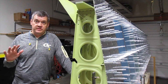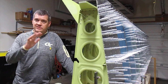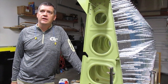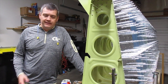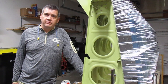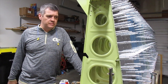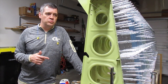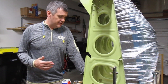There are a couple of methods of doing this — the plans even describe this. Typically you can use a rivet gun; you have to use a rivet gun for these, you can't squeeze them, and a bucking bar. That's the typical method of riveting, that's how we did the tail cone skins and so many other skins. But the plans give you an option to consider back riveting the wings.